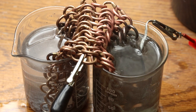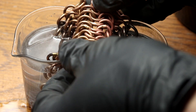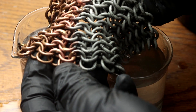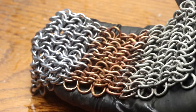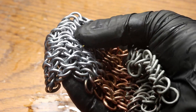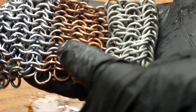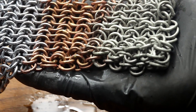It's been about 10 minutes, let's shut this down. Looks like we got a nice coating of tin there. Here we are after rinsing the solutions off with water. As you can see, this side is zinc plated, the middle is just plain copper, and over here it's got a coating of tin.